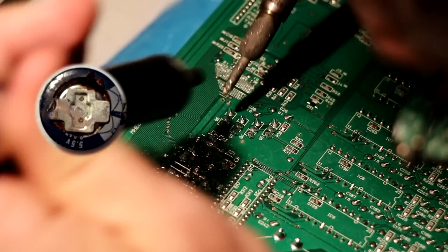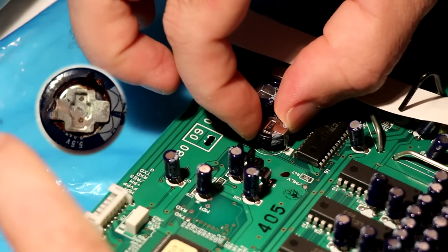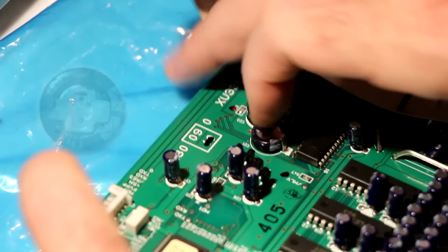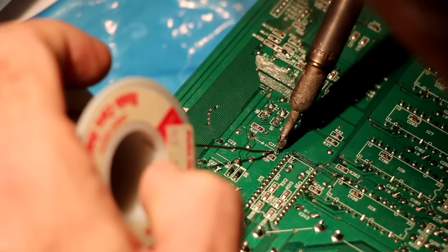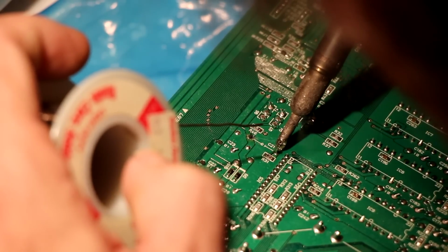The back of the capacitor was crusted over with this brown residue. I don't have any visuals of testing the replacement capacitor, but I can honestly say that it solved the problem. I had the unit unplugged for several days and it retained the user settings properly. The final step is to talk about the audio problem and the importance of IC5.